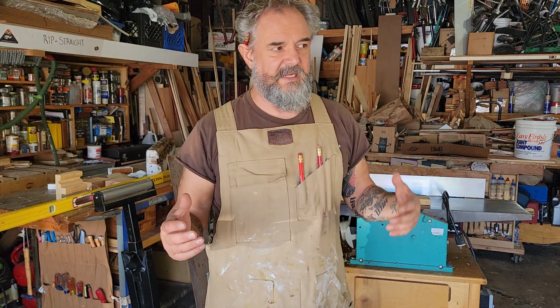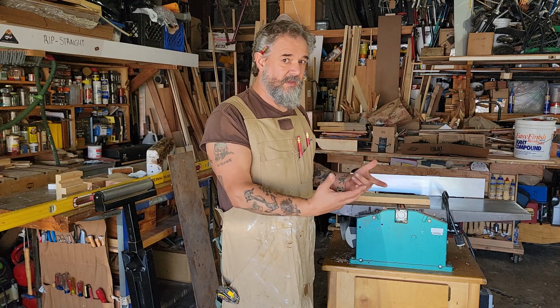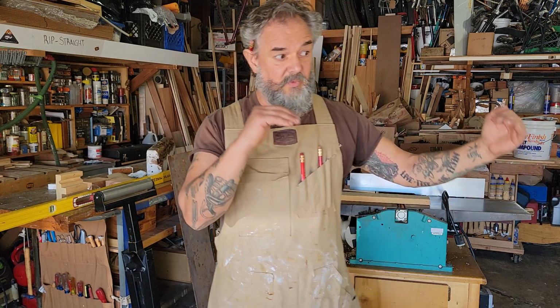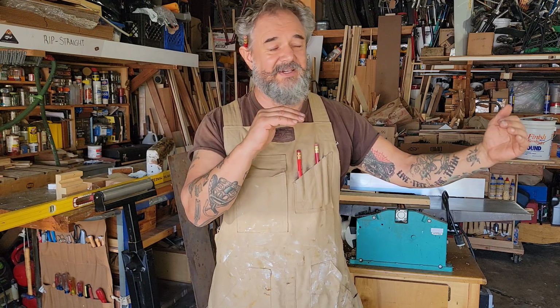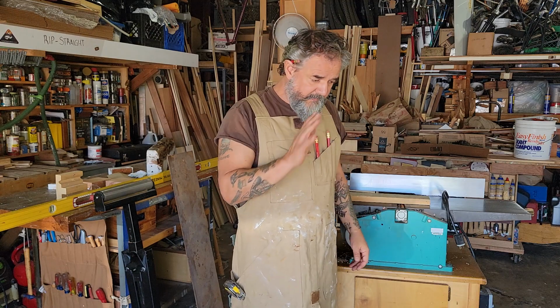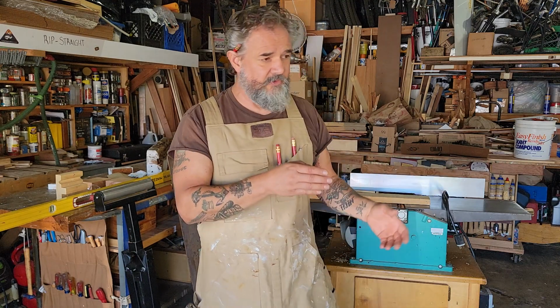So I had to go through this whole process, which is what I'm about to do for you, about the techniques that you want to employ if you want your net result to be a board that will remain stable, highly unlikely to move over time. That's subject to moisture and things like that, but for the most part should remain stable. Now, wood selection is a thing. When you're at the lumber yard, you want to sight all your boards. You want to try to pick the boards that already look relatively stable.